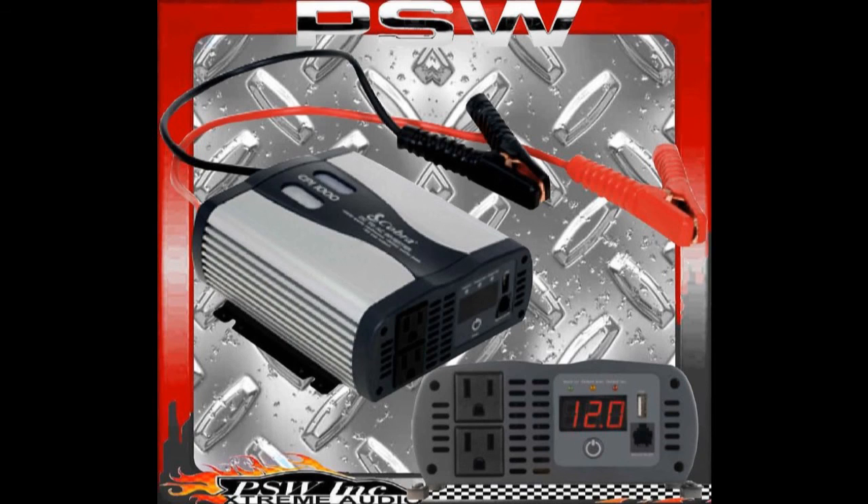Since I knew it was my fault, I went back to Walmart and bought the last one they had. When I got home, I disconnected the ground prong wire that was plugged into the inverter from the house mains and isolated the inverter from metal by placing it on a board. Then it worked okay until I got my Trace inverter. I'll never buy another cheap inverter.